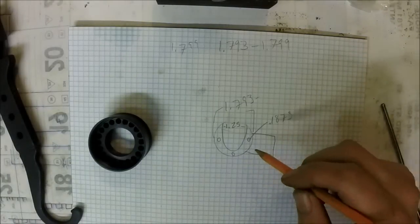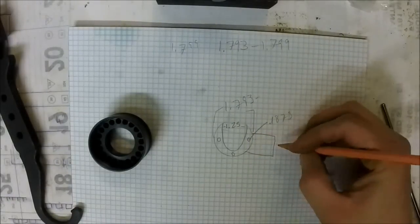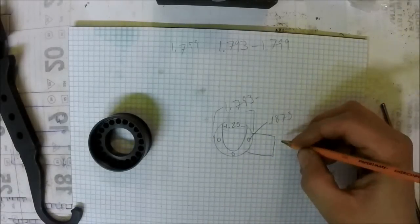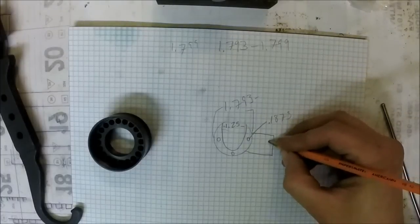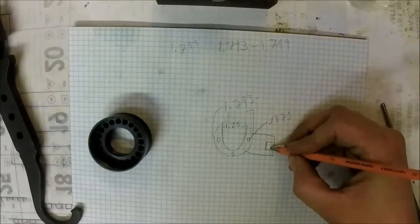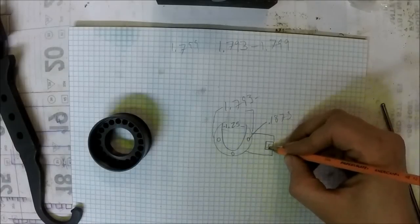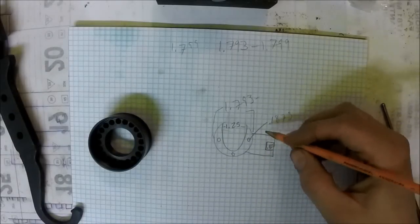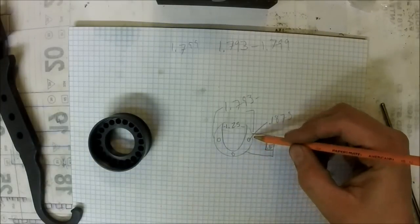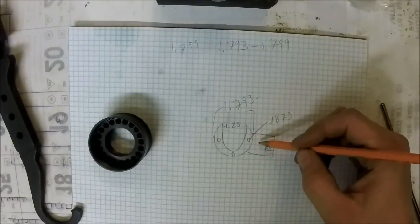So the dowel pins will be 3/16, and then the arm coming off, I haven't quite decided how I'm going to do it. I don't have a square broach or anything, and my torque wrench is a 1/2 inch torque wrench. So what I'm kind of thinking about doing is just cutting a slot like this that I can stick the wrench in and apply the torque that way. So I'll just make a 1/2 inch cut right here, and then I'll have to cut this radius, or close to that radius, in, and then hand fit it and weld this part on.